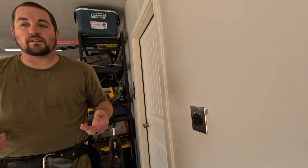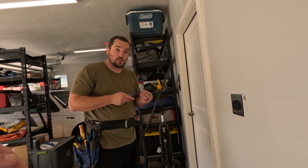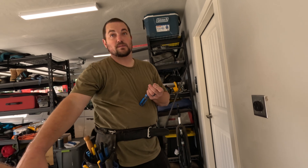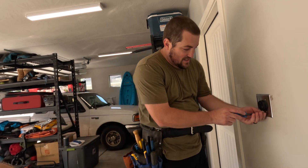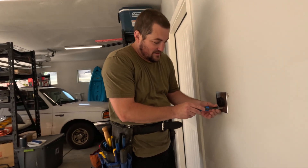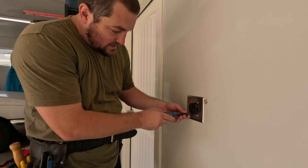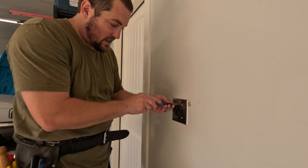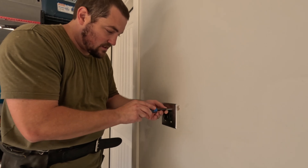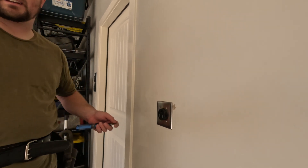This wire is called NM — it has that outer sheathing on it. Eight wire can hold 50 amps, but only if it's THHN. In the code book, because it has the extra sheathing and there are three wires bundled together, they say it's going to heat up more than single strand wires, so you have to derate it. Eight wire in NM style can't hold 50 amps — it can, but according to code it shouldn't because it's bundled and has an outer sheathing. Individual strands of eight wire are totally fine.